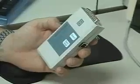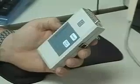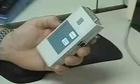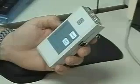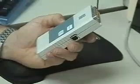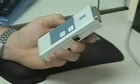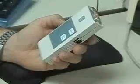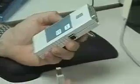and show you the auto mode and how you can load and unload programs and delete them off the Data Shuttle. It's a solid-state device. It uses USB and serial, and it can actually be powered from the controller if you have a controller that has power coming out on pin 25 like Fanuc, and at the PC it's powered by the USB.